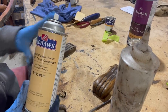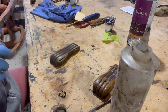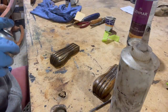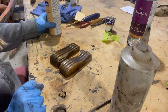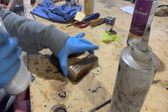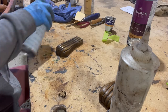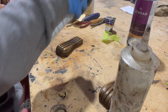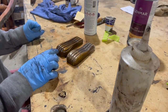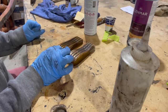I've got a light oak toner here, I'm just going to give it a little bit of a light touch. I think I could use a little bit of burnt umber, so let me grab that too — just to give it that kind of orangey tone that we're seeing there. That's kind of in line. Now we can take the finish off of this one and get it to look just like this one. I can see the tones are right.